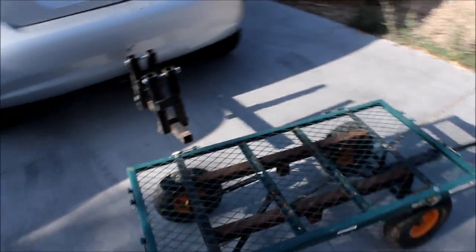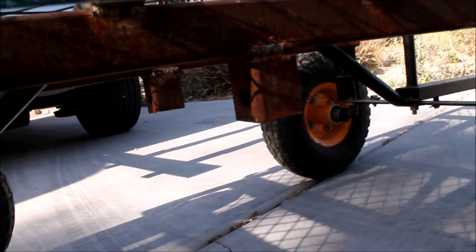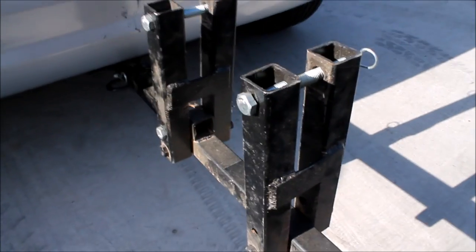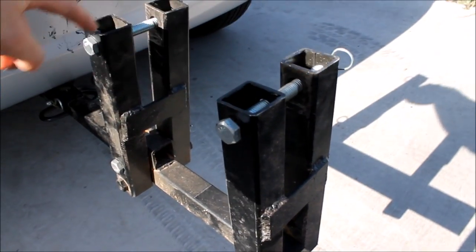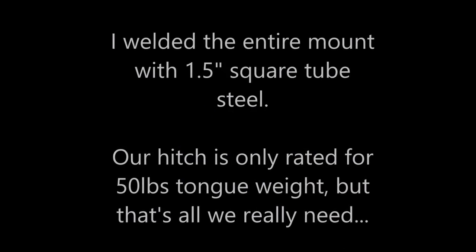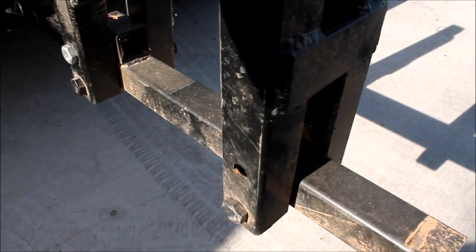So we bought this from Home Depot, and what I did was I first welded two pieces of steel on the underside as braces, and under them are two little pieces that have holes drilled in them. There's a hole in the side of each of these and those correspond with some pins that I welded up right here. They have a cotter pin, and those line up with two bolts, and then this receiver carries them — it just goes right in my regular trailer hitch and comes out, and they both pivot right there.